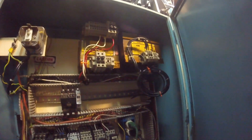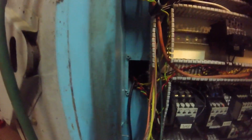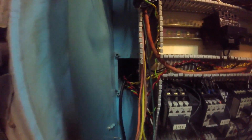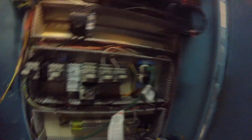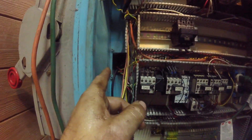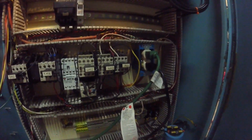If I can get more voltage, then obviously I want to. The voltage comes out of here - AC goes down through here into a bridge rectifier, which changes it to DC, into a capacitor, along through here, through the tunnel to the other side. You'll see where that comes out on the other side. There are a couple outlets here - this one's for coolant, this one goes to the other side. There was something I needed 110 for over there.